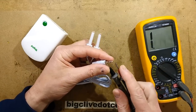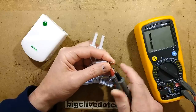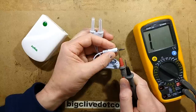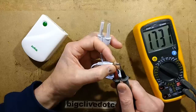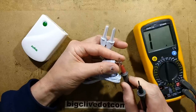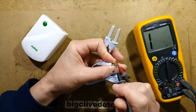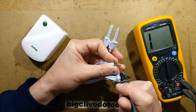Let's check the jack connections with a meter. Is that negative and that positive? The LEDs have just lit up — it's showing the drop across the LEDs. I wonder if they're just in parallel. The tip appears to be negative and the ring appears to be positive, and the other connection — let's check resistance — I think it's just a standard connector and nothing is connected to the middle connection at all.